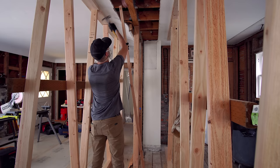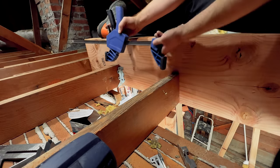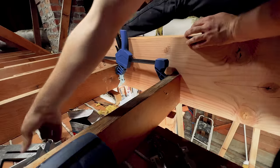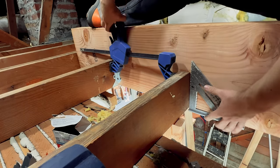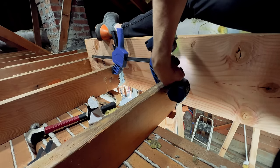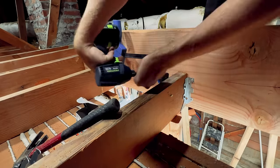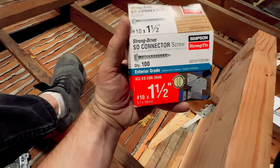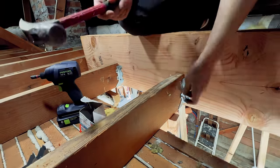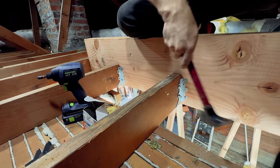It was a massive relief to have the beam up. All that's left is to hang the joists using joist hangers. I turned my Rockler one-handed bar clamp inside out to use it in pushing mode, while Luis from underneath raised the joist with a 2x4 wedged underneath — this kept it at the correct level and completely square. For those asking why I'm using screws on the hangers: these are the correct structural screws slated by the manufacturer — you can't use any old screws. For the toenails, I'm using 16D sinkers, also slated by the manufacturer.